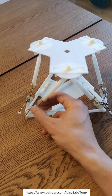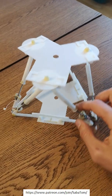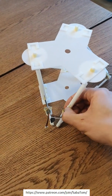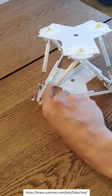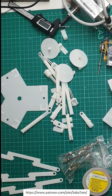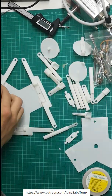Normally what I see people do is have an over-constrained configuration where the legs interact with each other, which can damage the joints. Because this is configured in a statically determinate way, you can experiment without breaking it.